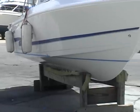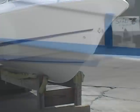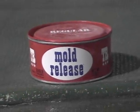Using the best masking tape helps you remove it later on. Extended use is blue. Mold release wax is tough stuff. It helps the boat separate from the female mold, and they put a lot of this wax on the female mold before they spray it with gel coat. If they don't, they get a lot of damage to the mold, like shown here.